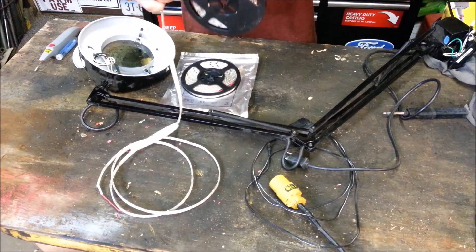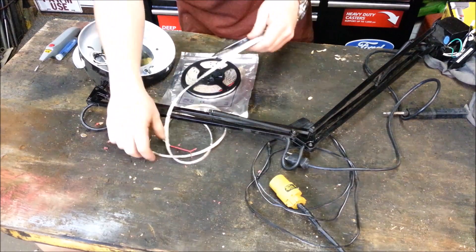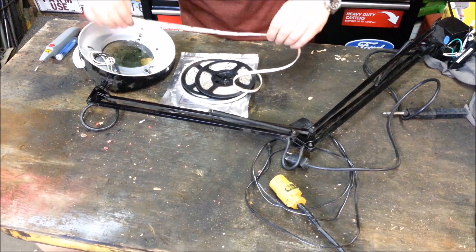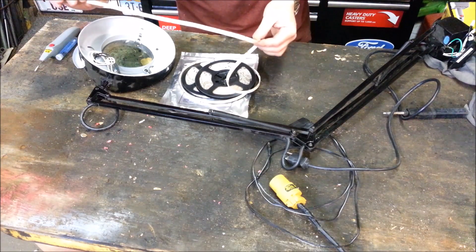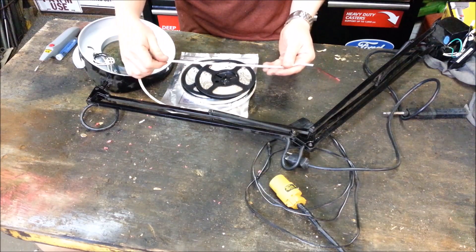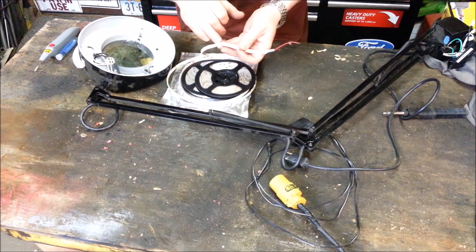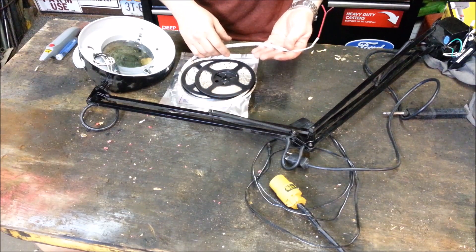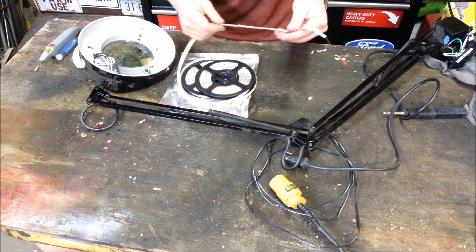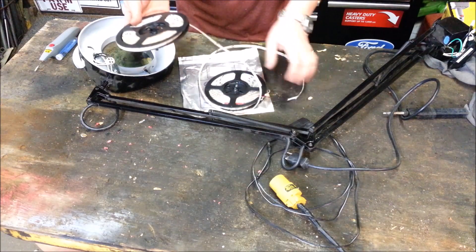I have a bunch of this stuff — it's kind of like rope light but it's not. It's called a 3528 LED strip light. I bought this a few years ago off Amazon for under-cabinet lighting when I redo my kitchen. Just one strand was amazing — it adds plenty of light under the counters. It runs off regular 12 volts, so you could even mount it under the dash in your car. It's called 3528 because the LEDs are 3.5mm by 2.8mm. They also have 5050 — 5mm by 5mm LEDs — which are more expensive but put off more light. I think I bought both rolls for around $15.